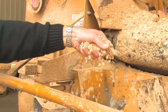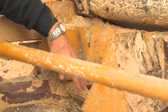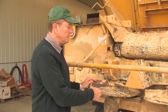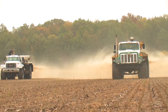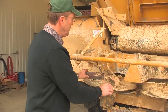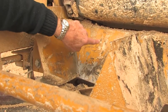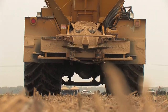We need to have the material flowing off the belt unrestricted onto the fans. Gypsum is a very fine material, and as it flows off the belt onto the fan and hits the blade, it's going to remain on the blade a little bit longer than a granular — therefore placing more material on the outer edges of the pattern. We want to push the deflector so that it drops the gypsum sooner on the blade, so that when it releases, it releases in the center of the spread pattern for a more uniform pattern.